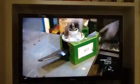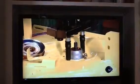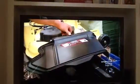They assemble three spindles to mowing blades and hoist a mower deck over the blade assemblies. They bolt the head of each blade sub-assembly to the mower deck. Then they thread rubber belts around pulleys to drive the blades. Assembly continues with gauge wheels, a protected belt casing, and a chute for the cut grass.